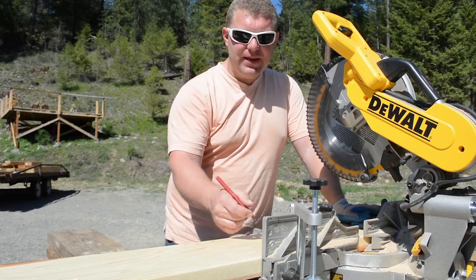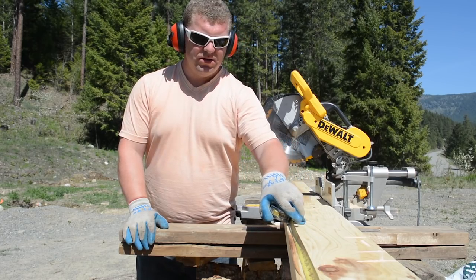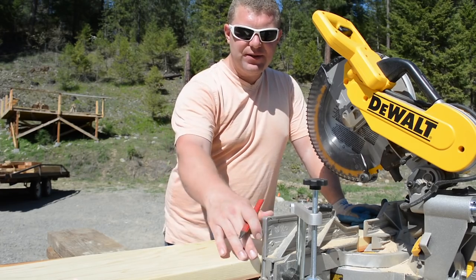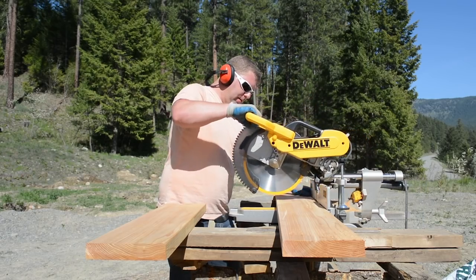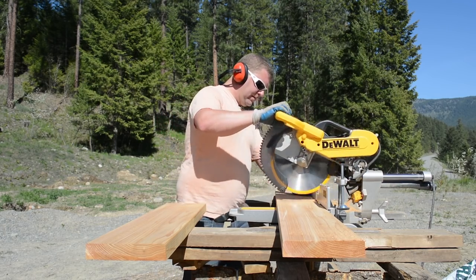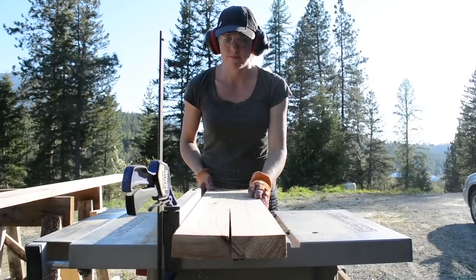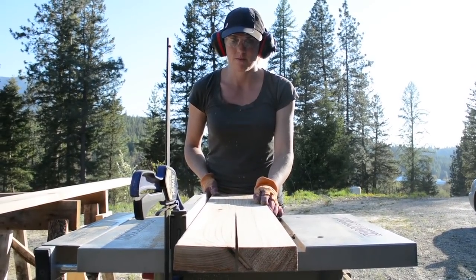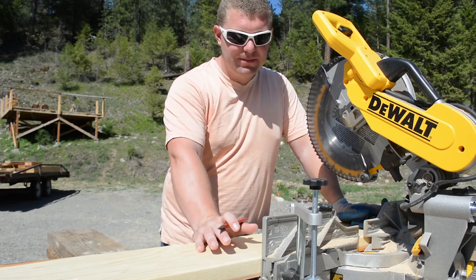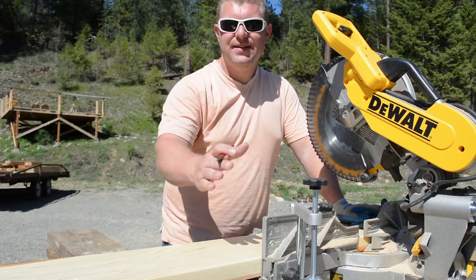So what we're going to do is carefully isolate in each board where the clear wood is, then devise a way to get that wood out with the least amount of waste. Sometimes that means using the chop saw to cut the ends off a board first, and sometimes it means ripping the board in half first — because sometimes two staves are right next to each other but offset, and a crosscut first would cut across one of your perfectly good pieces of clear. So it's going to be a bit of a process. Come along with us and we'll make some hot tub stave stock.